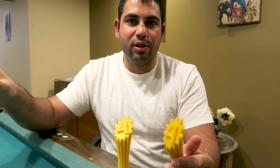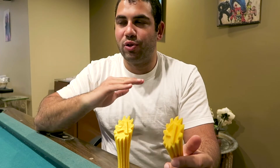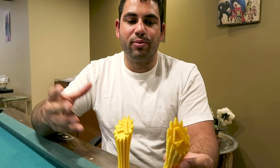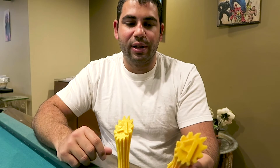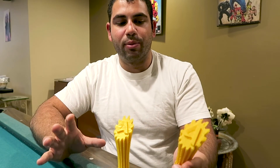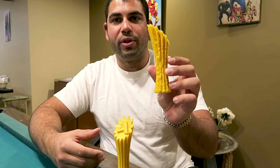I didn't try printing with the hotbed temperature shut off completely, because the hotbed is there to help — it ensures your piece doesn't move by slightly melting your supports and structures to the bed. Obviously this was still too much heat, so in future prints I'm going to continue lowering the bed temperature to keep improving on what the print looks like.